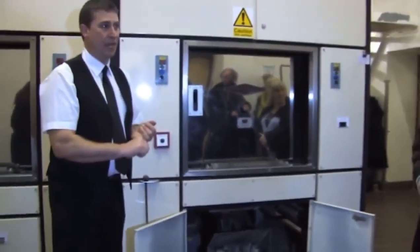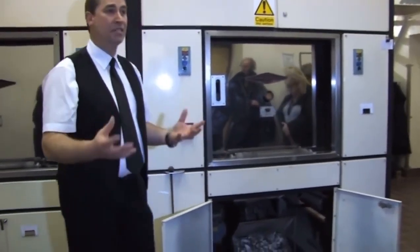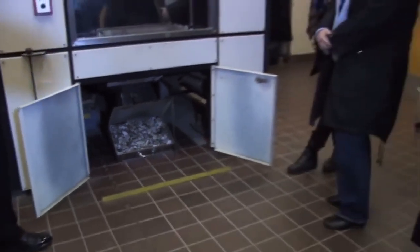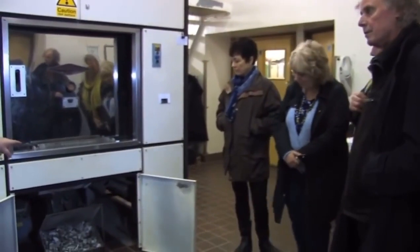Now, when I say everything, all the tissue has been burnt up. There's no tissue. You'll find the bone remains and also glowing embers of the coffin, all right? That does take quite a while to get rid of. So whatever is left, we will rake into that chamber. It's blasted with cold air. The cold air will do two things. It'll burn off all those glowing embers of the coffin, and it'll also start to cool down the bone remains, all right? That's the second stage.